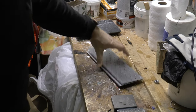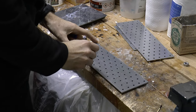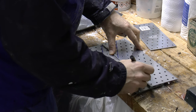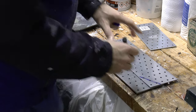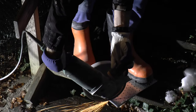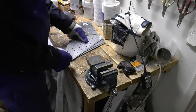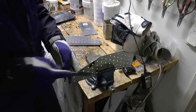I plan to use some leftover metal as sliders and shape them to not get stuck on unevenness in the ice. The steering plate at both ends, as I thought it would make turning easier. With an angle grinder, I cut out the profile and do some trimming of the edge.